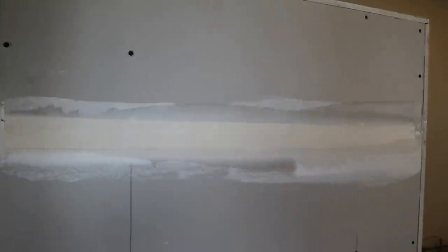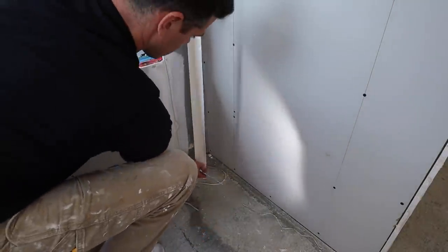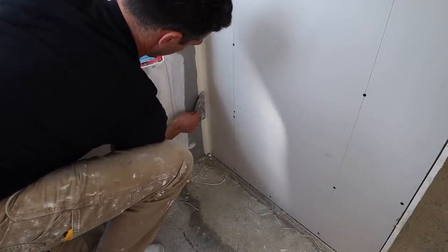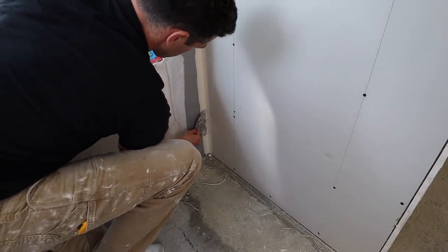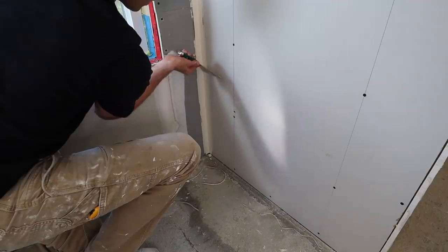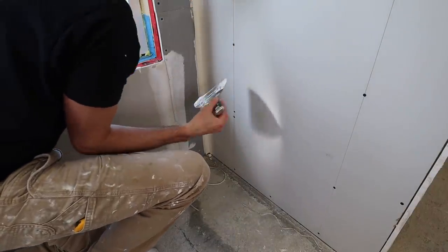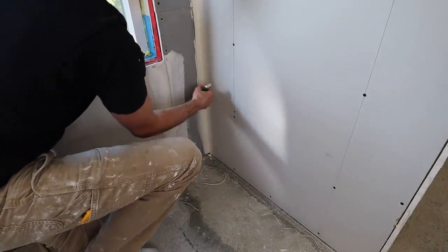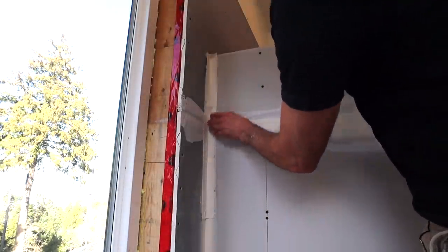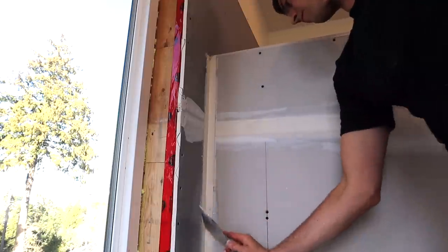If you keep this close enough you can actually just add the mud right back in here. Now when it comes to corners, you can still use this tool — it works pretty well. Just line it up in the corner and the tape is going to want to crease right in the middle on that line. Use your knife to press it into the right spot, then wipe out one side at a time. It's also perfectly acceptable to overlap small tapes where necessary — don't do it on butt joints, but on a factory joint or on an angle it's not going to be a big deal because there's going to be enough mud to cover it after.